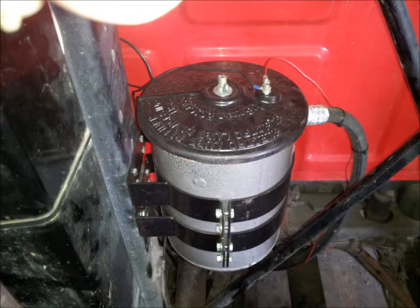At the rear of the cab, route the red power wire up along the oil return line to the refiner canister lid. Strip the end of the wire and crimp the number 10 blue hoop connector provided onto the exposed end of the wire and attach it to one of the heating element posts on the lid. Does not matter which, the heating element is not polarity sensitive. Secure the wire routing with the tie wraps provided as required.